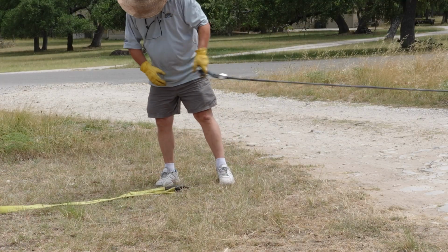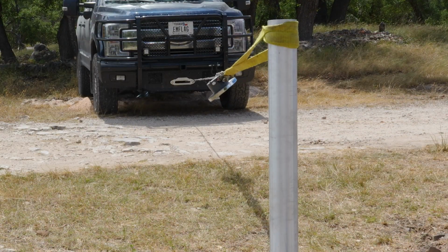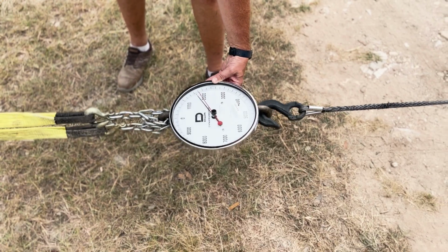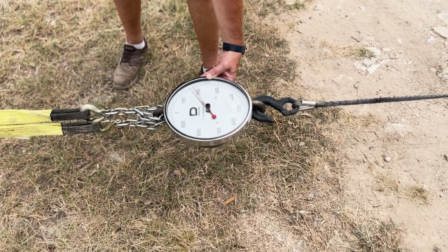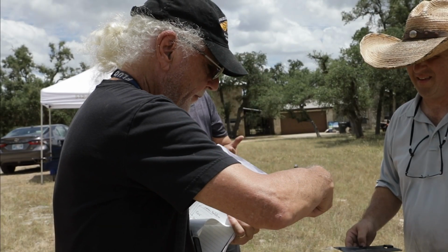A dynamometer was then attached between the flagpole shaft. Lateral pressure of 1,800 pounds of continuous tension was applied. In addition, repeated pressure and release motions were also applied for deflection testing. Troxel Engineering compiled the data and provided a stamped analysis report of the results.